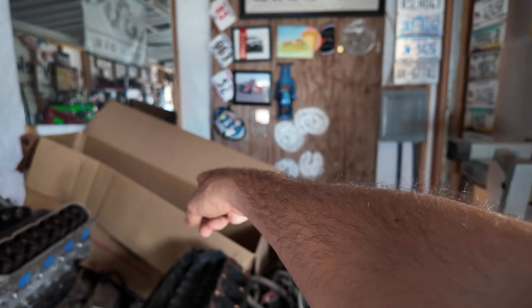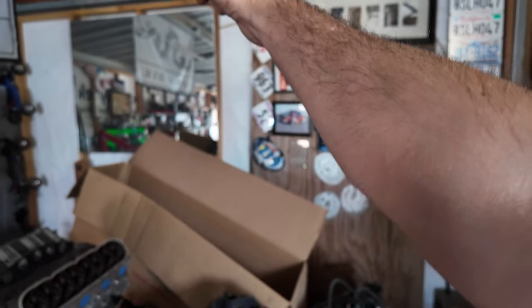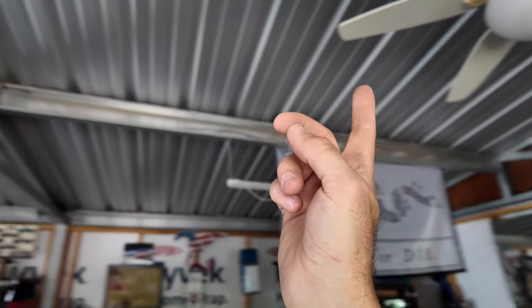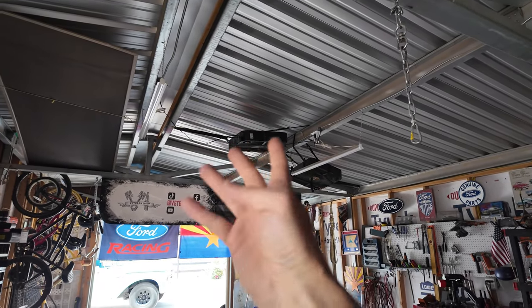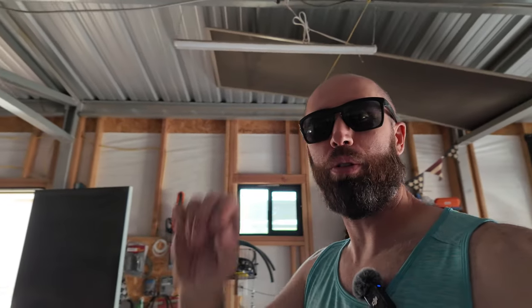The ducting for the swamp cooler is gonna come out there and go up and then down the length of the entire shop. And I got four registers for it and six inch ducting. So that's gonna be a massive amount of air moving through a little tiny hole. So it should have some velocity if it doesn't blow the registers off. Probably keep it on low speed.